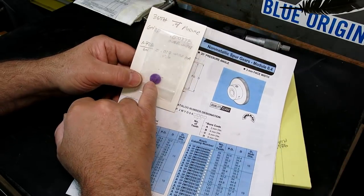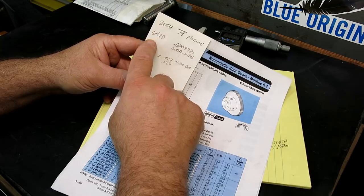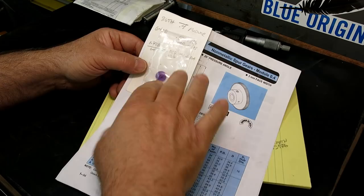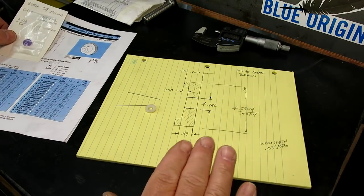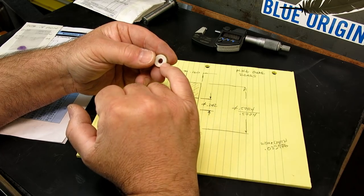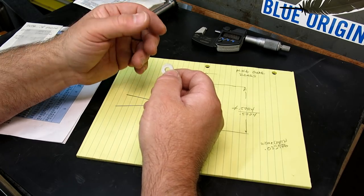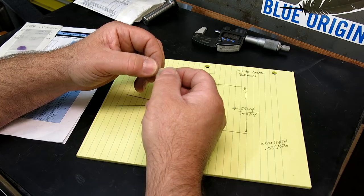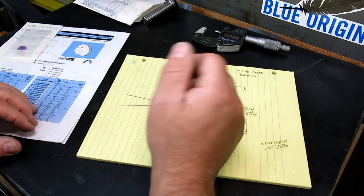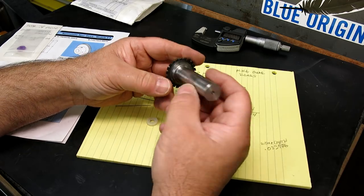There's more to this story — this is an involute gear form. At first I was thinking I'd just hand grind a tool, but to get the tooth form correct you technically can hand grind a little fly cutter bit. Instead, I checked on eBay and found a 0.4 module involute gear cutter. It happened to be in China, brand new. The cutter plus free shipping was 15 bucks. I didn't want to pull a blank tool steel out and grind anything for that kind of money.